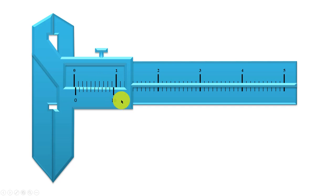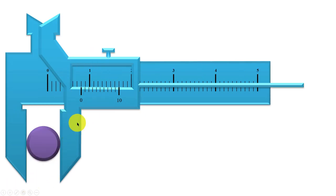When that is the case, the vernier calipers has a zero error. That means that whatever scale reading we get is not equal to the actual measurement being undertaken. If the vernier calipers has a zero error, the scale reading is not equal to the actual length being measured — it is either greater than or less than the actual value.